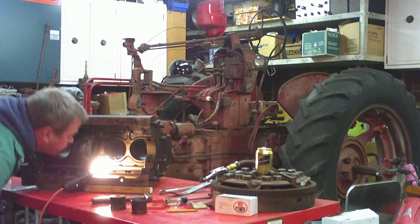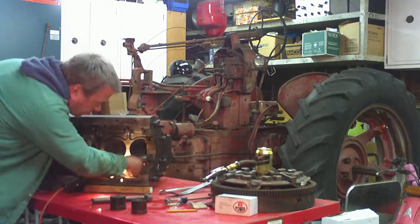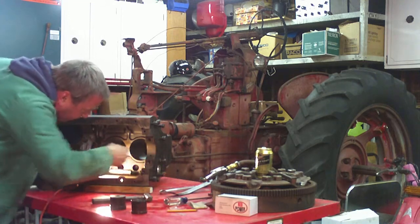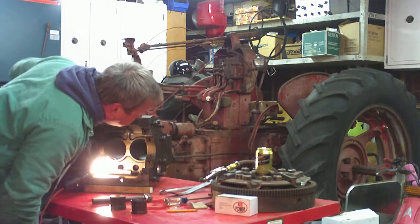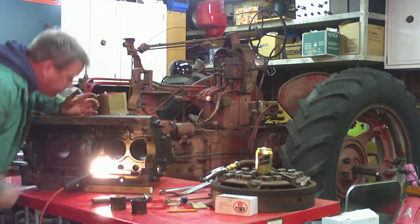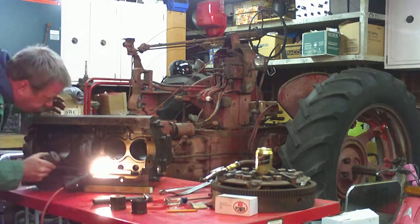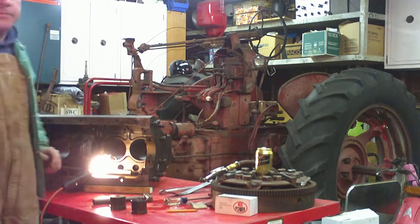Now I've got my bearing flushed. At this point I'm going to check to make sure everything is going okay, because I don't want to overdrive my bearing. Just looking at my oil alignment hole shows that I've got just a little farther to go. So we'll tap that in just a little more and be done with it. Simple as that.